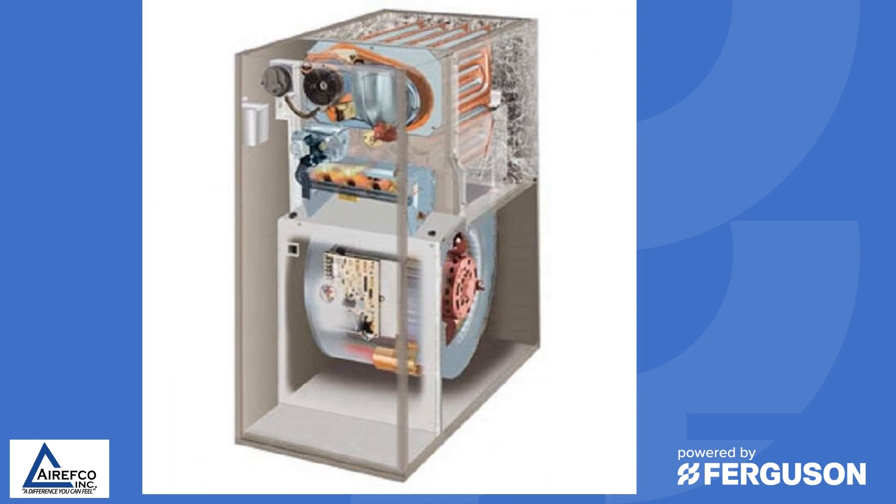After completing our initial observation of the furnace installation, we open up the doors and continue. One of the first things to look at is the inducer motor. When a furnace gets a call for heat, this is the first device that starts up. The inducer motor's purpose is to provide induced draft through the secondary and primary heat exchanger for proper furnace operation. Make sure the blower wheel of the inducer motor is clean and that the inducer is coming up to correct speed. This can be observed through the pressure switches, which require a certain number of water column inches to make contact.